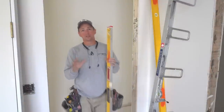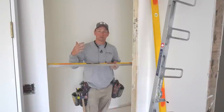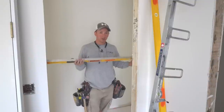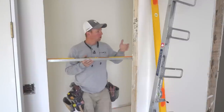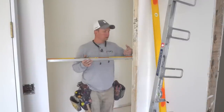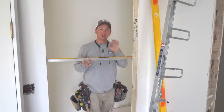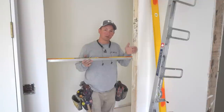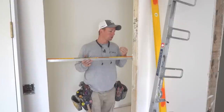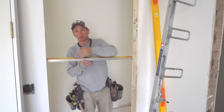There are some really important keys to success with an eight-foot door. First off, we need a lot of shim points and we need those shims in the correct location. As anyone knows who has hung very many doors, cripple studs are not always running perpendicular to the plane of the door. If you want a door that hangs perfectly and swings perfectly, the closer you can have your jam to perpendicular the better. That all starts with having your shims running perfectly perpendicular to the plane of the door.